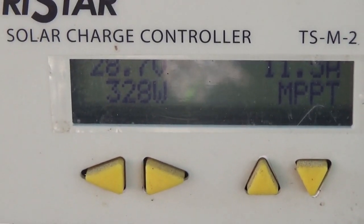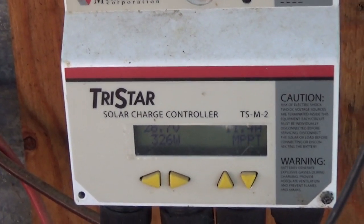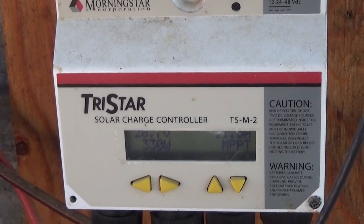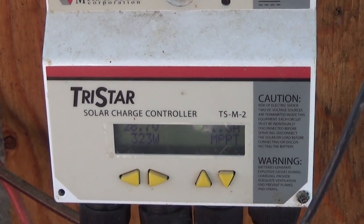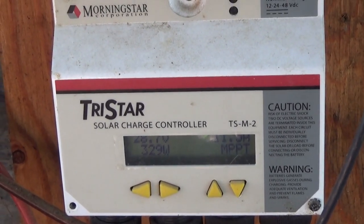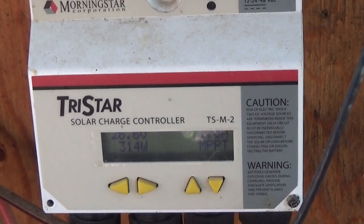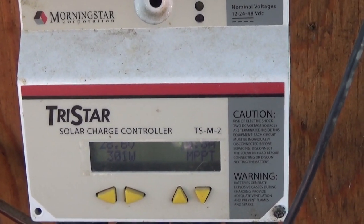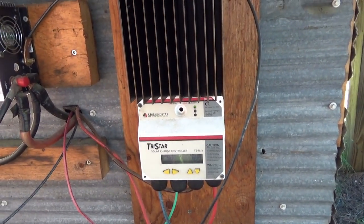Still not pulling that much — 325 watts, 330 watts, fluctuating a little bit. I believe the batteries have taken what they needed and the sun is getting more direct on the solar panels. We're only pulling 300-some watts combined with the fridge and freezer, which sounds about right. My freezer-conversion-to-fridge experiment pulled 150 watts when it ran, so 300 watts for these more efficient units sounds right.